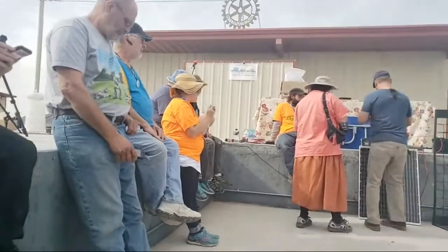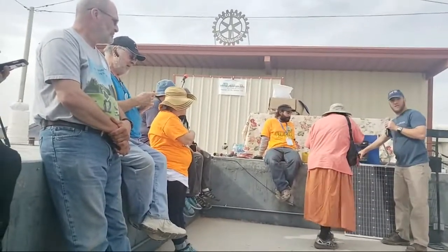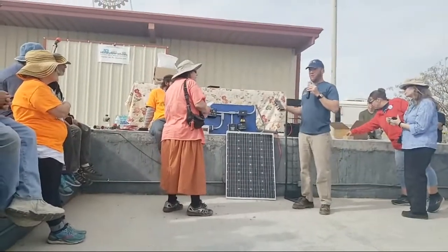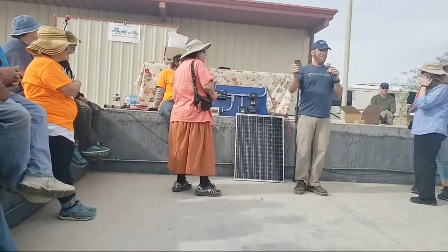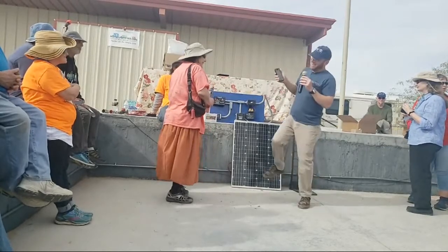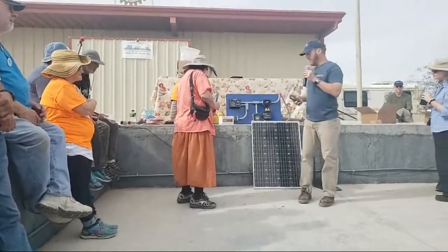But you can see, turning off the load, the amount of current going in and out of my battery goes back to positive because we're actually charging. And if we step away from the panel, we're doing 16 watts. If I angle this panel, it's going to get a little bit better. Angling the panel makes a huge difference. That's one thing that's nice with the app: you can drive around, and when you find a place to park, you can adjust the angle of your panels and find in real time how much wattage your panel's putting out. This is one of the nice things to do.